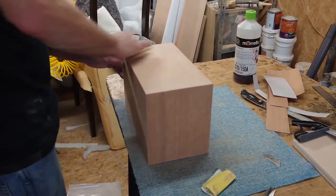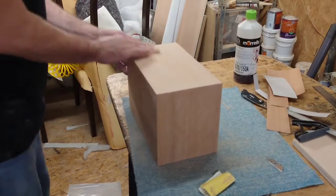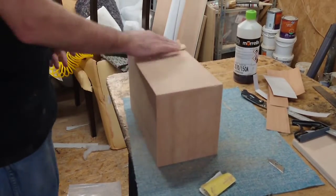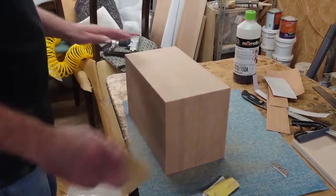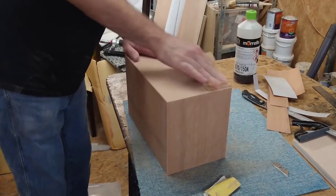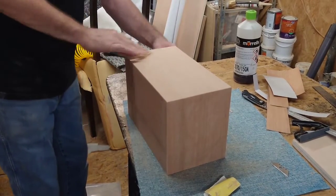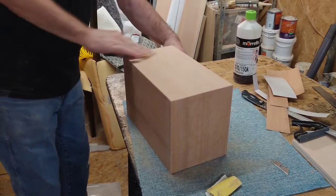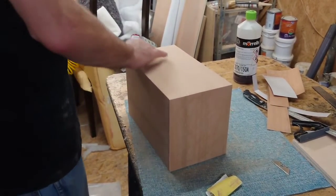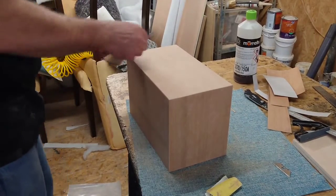I have been getting a little bit environmentally friendly lately. I've been using quite a lot of water-based lacquers. I would never use those on tabletops, only on chairs where the wear factor isn't as bad. Because the problem is you don't want somebody to come back to you in a year or so's time to say the finish has worn off. I did use a water-based lacquer on a table once and it didn't really last that long.